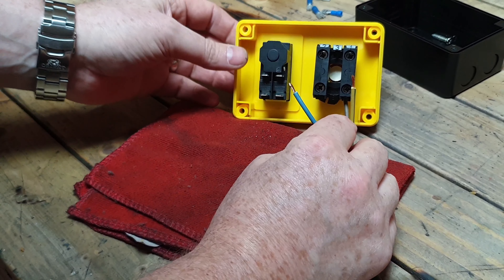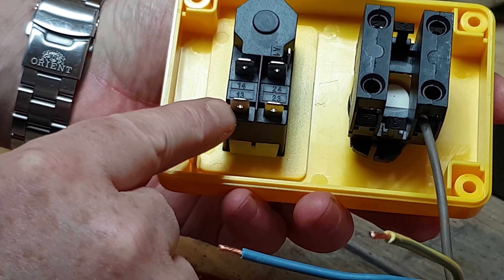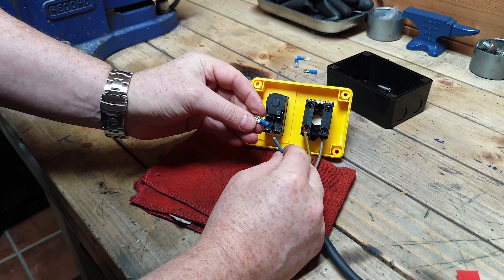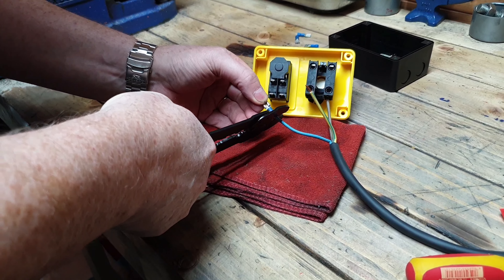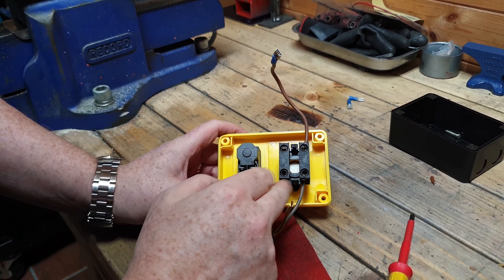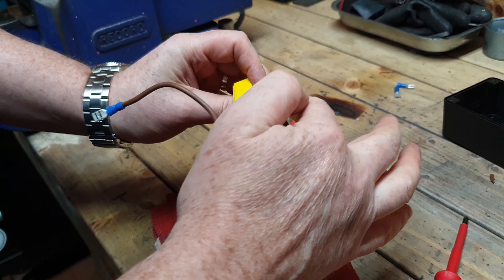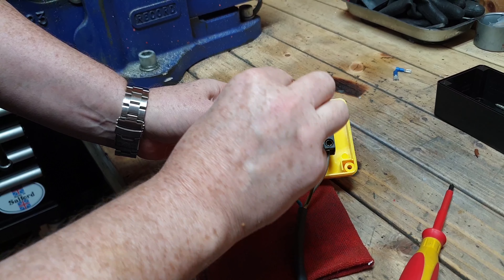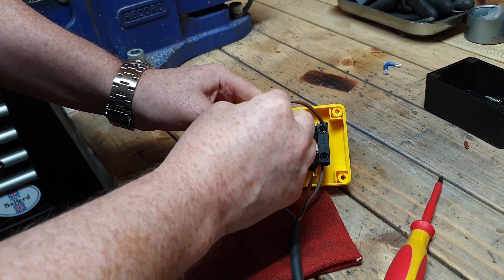So the blue, or the neutral cable, that connects over to the switch side and it connects to the terminal on the bottom left, which is numbered 13. However, to do that we need to put on a spade connector, so I'll crimp that up. There we go. So once they've been connected, we're going to make a bridge from the emergency stop number one terminal to the switch number 23 terminal. So that's been screwed in there, and I've put another spade connector onto the end and popped that on there. Then we just tidy it up.